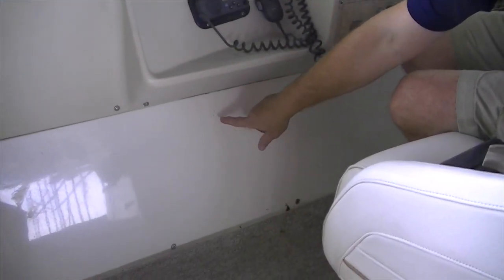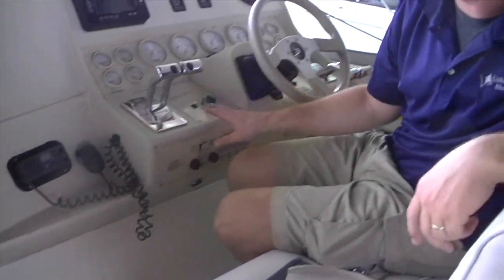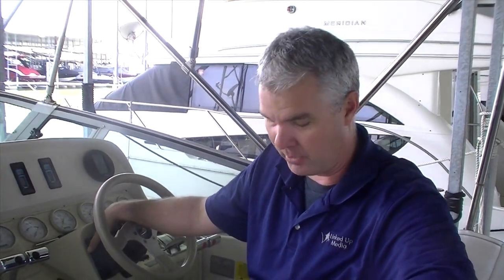We're back with another episode of repairing this big old boat. It's just some maintenance items we got to take care of. The other day I was driving around and noticed the steering wheel was kind of clunky — it would bump bump bump. Below the helm we had some dripping going on coming out from behind here. We took apart the dashboard and discovered the pump has a seal that's gone bad. With these Teleflex hydraulic pump systems it's pretty common, so I went ahead and bought a seal kit.